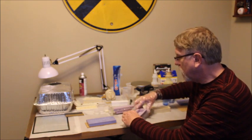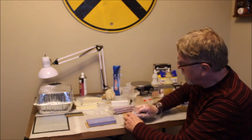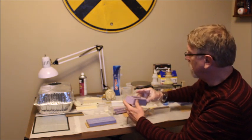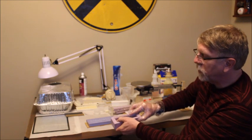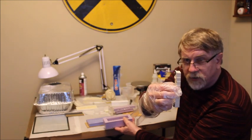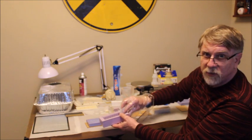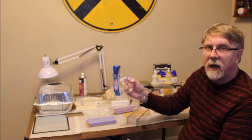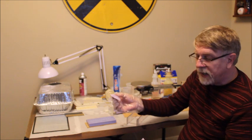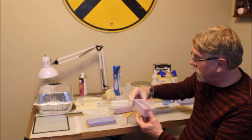let's see here. I'm going to remove this. When you pull this out of here, when you start bending this mold, and this had large undercuts, because remember this was the one that had the large undercuts on the end. So pulling those large undercuts out with a cold mold, it will really stretch and tear, and as a result, it actually tore from all that stress of pulling those large undercuts out. It actually tore the end of the mold off and wrecked this mold for use.